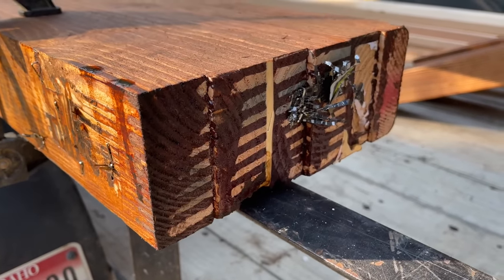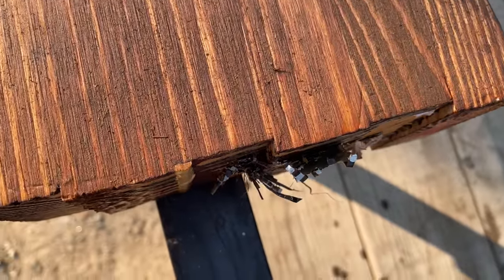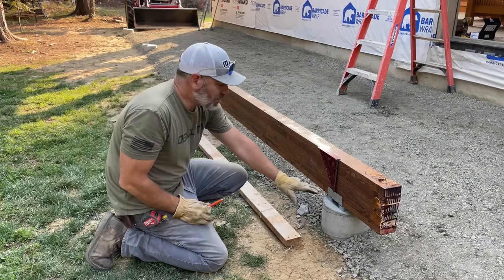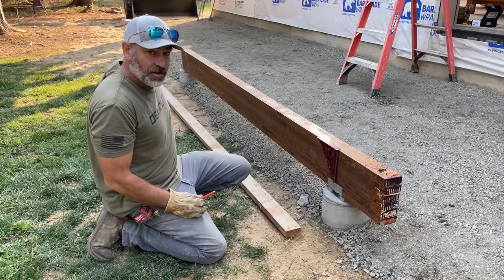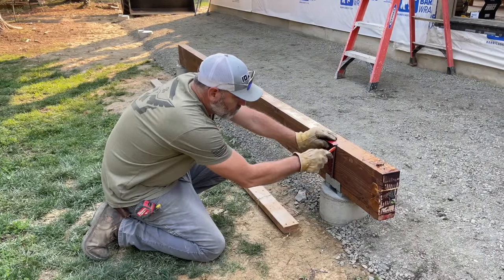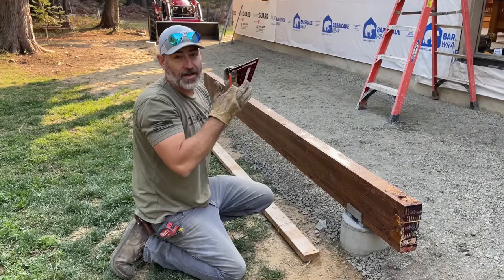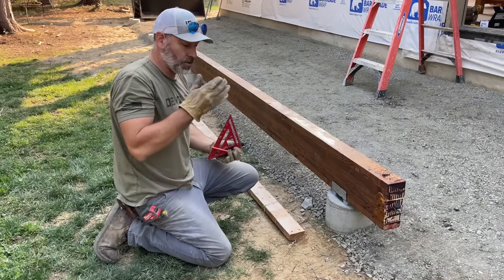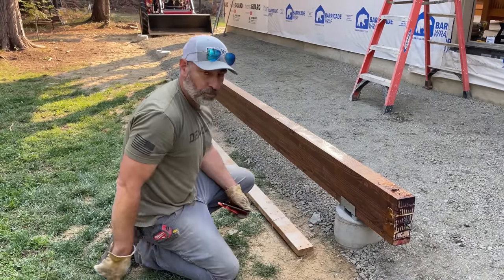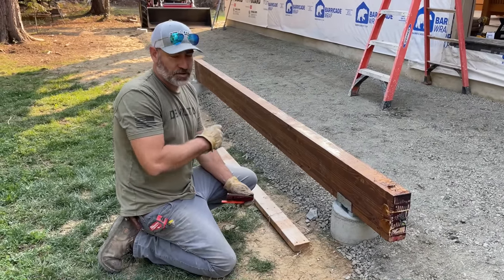Take a look at this end on this beam - it is super ugly. Glue totally uneven, plastic, yuck - we'll be cutting that off. The post is going to go right here, so we're setting our beam centered on the one down there, coming here, taking our square, putting it up, finding the center of this, marking it right here, then we can cut it right there. When we set it up on top of the posts, if the posts are plumb, it'll fit right in the center of the post.